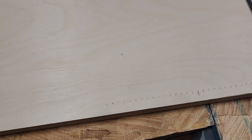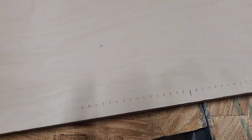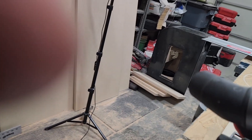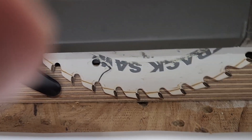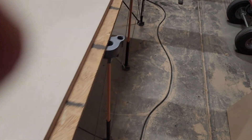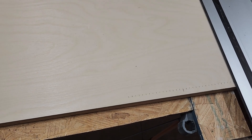What I'm doing, if you're curious about my kerfing technique: I put a mark about every quarter of an inch, and that gives me cuts that are a lot closer together than what you would normally see. I also leave a little bit more wood at the end. Some people go almost darn near through the wood, but because I leave just a little bit more, it's not going to let you know that it's kerfed — it just looks like the wood is bending. Anyway, you'll see. Here we go.